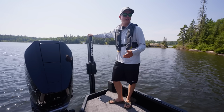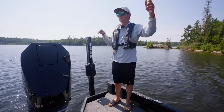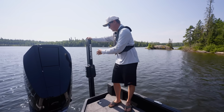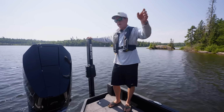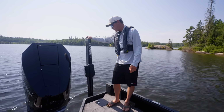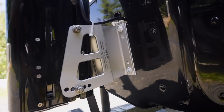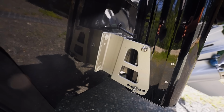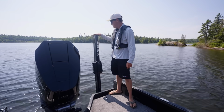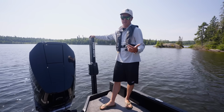Yeah, shallow water fishing, you pull into a bay like this and you want to cast. And if you anchor with your trolling motor, well, then your back is faced into the bay if you're pointing into the wind, right? So in this case, right now, the wind's blowing into the back of the bay, we're taloned, and now I can cast off the nose of the boat at the lily pads, at the fish. So I love having a Talon. This is the first time I actually mounted it directly to the boat. In the past, I've used a sandwich bracket. So yeah, I drilled right through the back of the aluminum, and it is absolutely rock solid. So 15-foot Talon, I guess it's effective to like 14, 13 feet, depending on what type of bottom you're dealing with.